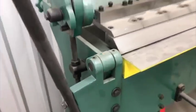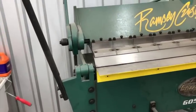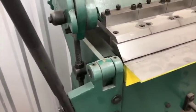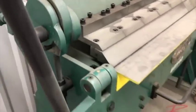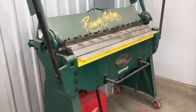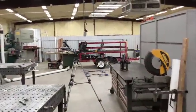It does have a zerk fitting - or an oil fitting - on the main pivot point, but there's no bushing. None of these pivot points have any bushings anywhere, and these are castings. I don't know if cast iron wears faster than DOM tubing steel - I would think it would - but if they can build something this big and use it for what it is and get away with that, surely a little metal bender could get away with not having a bushing in it.